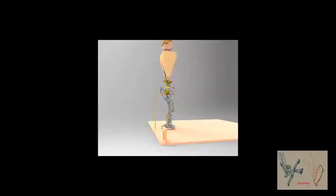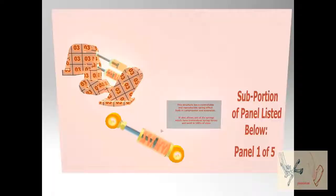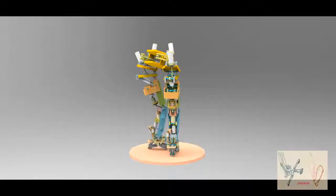We will be burning diesel fuel, and we want to be sure that we don't have a detonation or rapid burn event that would cause a noise. And so the diesel fuel will be injected into the combustion cylinder through a nozzle, and the nozzle will be heated up to 1,000 degrees so that the fuel is at 1,000 degrees when it enters the combustion chamber. The effect of this is that there will be no rapid combustion of the fuel or explosion of the fuel because it will be on fire immediately as it enters the chamber.